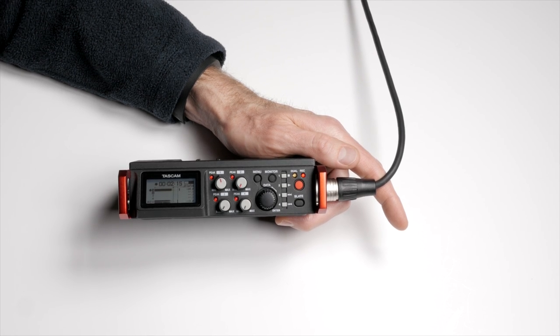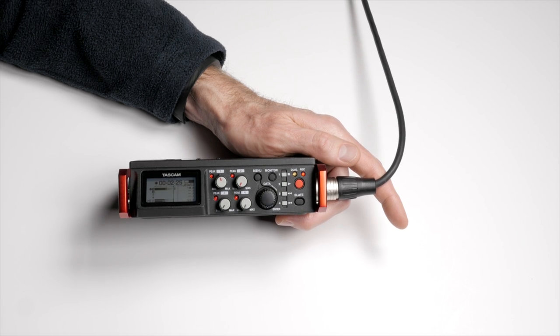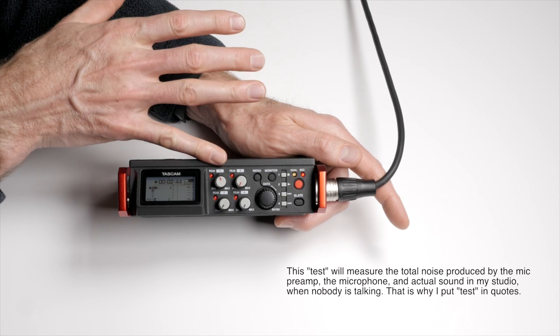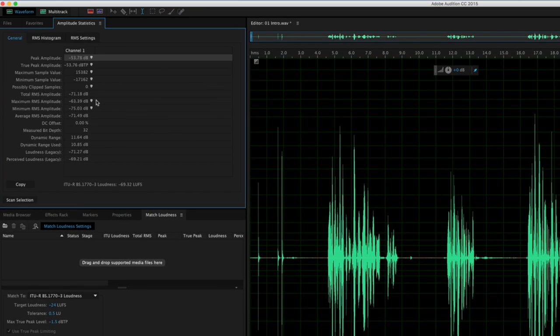I found these preamps to be very good. I recorded in my basement studio with sound blankets and old blankets on the concrete floor. I recorded 10 seconds of silence after the dialogue for a practical noise floor test, with the gain set to mid and the trim at about 50%. The average RMS amplitude was minus 71.5 dB RMS for that silence section — actually quite impressive, probably one of the quieter preamplifiers I've used, definitely in the same league as the Zoom F8. The max RMS amplitude was minus 63 dB and the minimum was minus 75 dB.